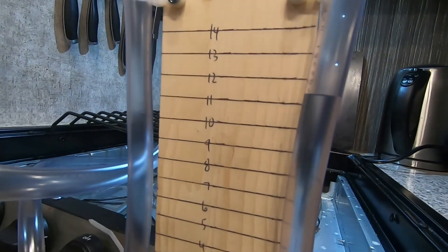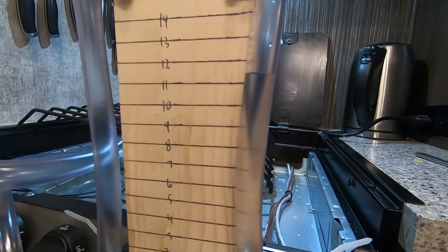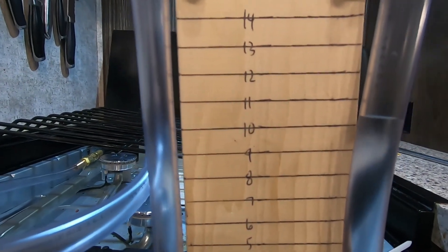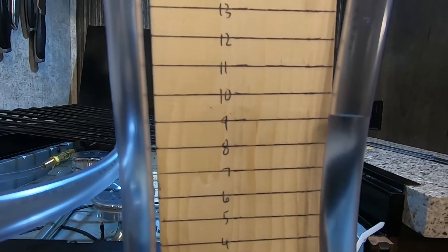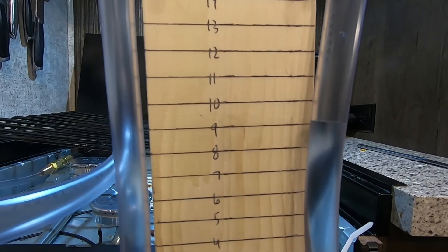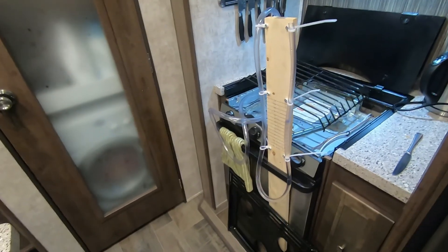So with new piping from the big tank, we're sitting at 11 and a half inches water column, which is good news. With just the water heater, it's at 10 and a half. When the flame kicked on for the furnace, it dropped to 9. Double multi-regulation apparently is a problem.